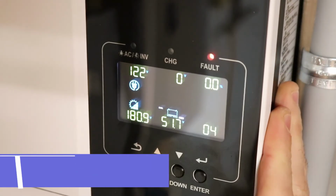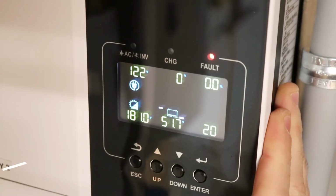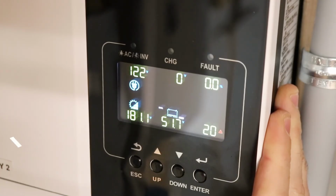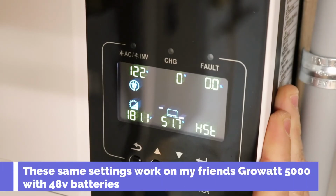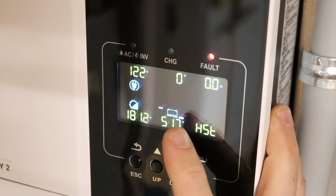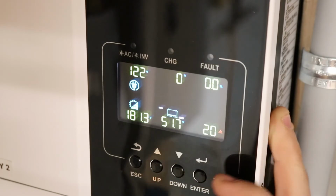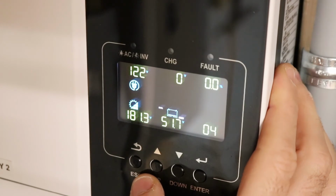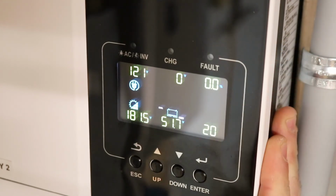Okay, you guys can see I have everything powered on. I have the ports, I have the dip switches configured on each battery correctly. I am going to go through and check those again. I have the Ethernet connections connected, the RJ45s to the RS485 ports correctly. It appears as though it's working because the setting here says LI, which is lithium. Here shows the voltage of those batteries, 51.7. I'm going to test those just to see if that's accurate.